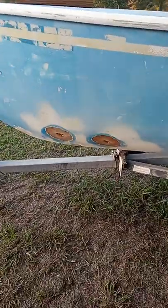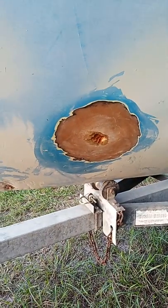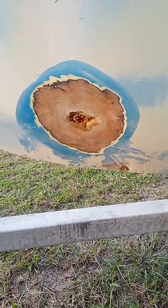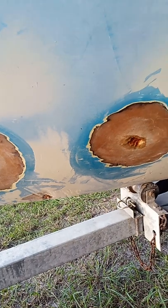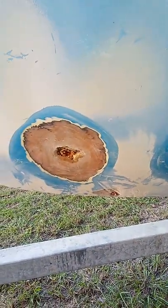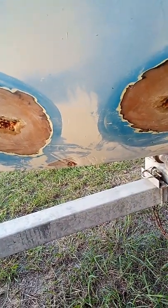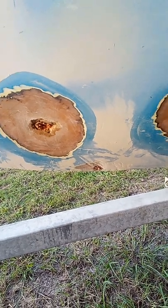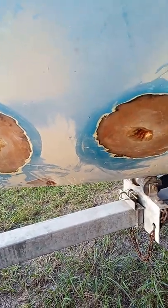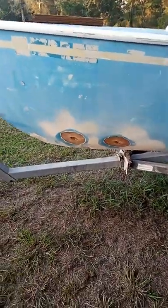I can't get to the other side because of the foam, so my first step is going to be using some fiberglass reinforced body filler putty to smooth out where the foam is and tuck it into the edges to help it lock in. The pickaxe holes are about two to four inches deep, so I used some spray foam to fill the hole and then shave it off on the outside — it's not adding much flotation, but it fills that void.